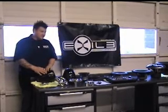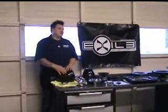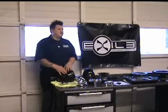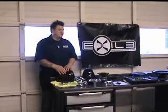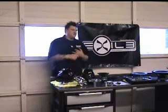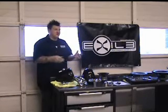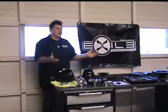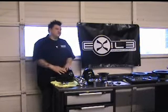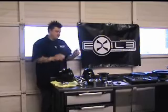Cabling is probably my biggest pet peeve. I can't tell you how many times somebody says that cable is $30, give us something cheaper. We've seen boat companies used to buying $6 to $8 RCA cables. When you get an inexpensive cable, there's a reason it costs less. The number one thing a cable does is transfer sound from your radio down to your amplifiers, so if you have a weak component there, everything downstream loses sound quality. In a marine environment exposed to weather, you need a cable that holds up over time — I've taken cables out of boats that are oxidized, changed colors, and been wet.